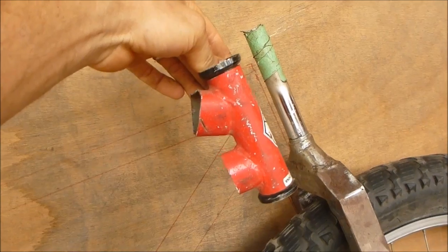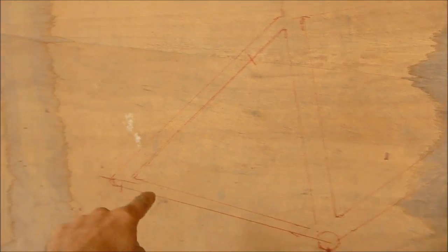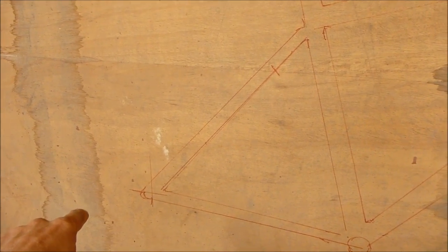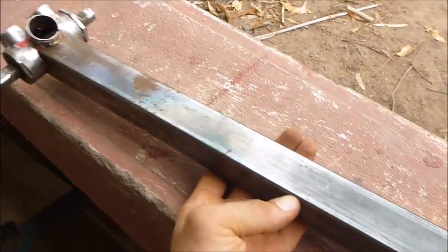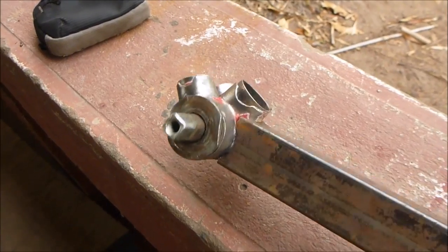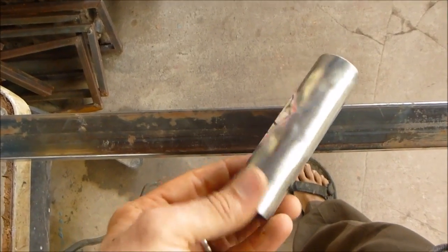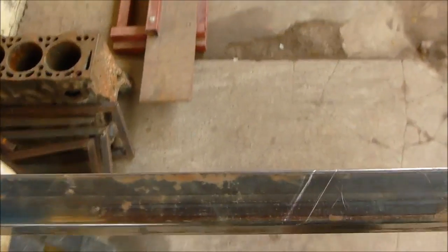And I think I'm going to try to run this bottom tube here and those bottom stays, what are they called? Rear stays. And then I'm going to work on the rest of it. I had the idea to make this bike kind of square and polished steel. So this is nested into that. I just have to weld that in place and then look at connecting the other side. Now the head tube is going to fit in something like that, so I've got to cut this off and put a fish mouth in it.